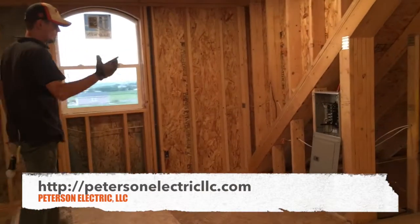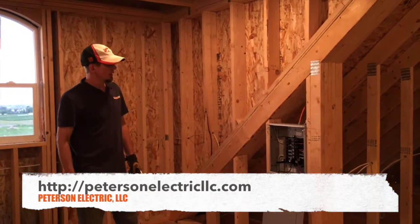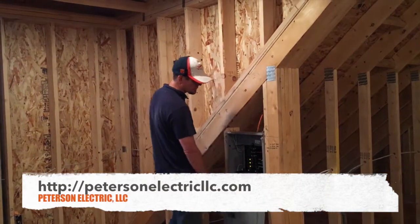They may put in a kitchen right here later and turn it into a mud room suite, so we put in a 50-amp panel up here — 6-4 again — with AFCI breakers. We tested all of our circuits before the drywall goes up and did a video. That's it, guys — hopefully this helps you out. This was a nice-size project we did over the Memorial Day weekend, and my wife and I just did it by ourselves. Thanks.